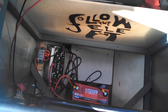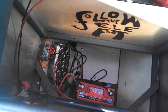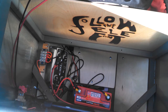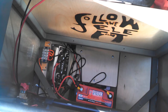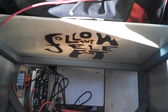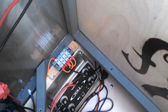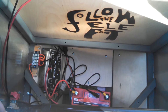That solar panel charges at 14.7 volts in clear view of sunlight. We had it in a different area where half of it was shaded and it had dropped down to 13.27 volts, so it definitely is affected by shade. But 14.7 volts is pretty good — that should charge our stuff up. This solar system essentially will help us work on things like video editing and anything else we'd need somewhere without power hookups.